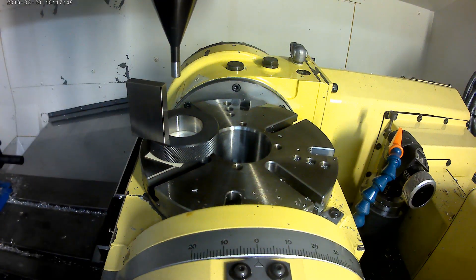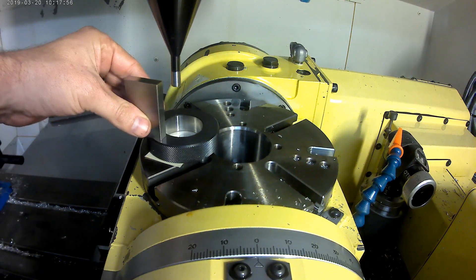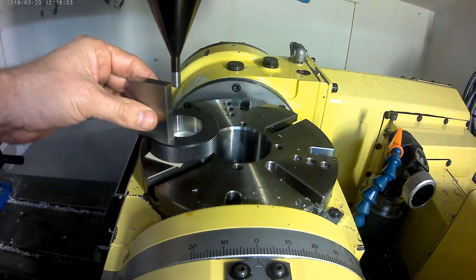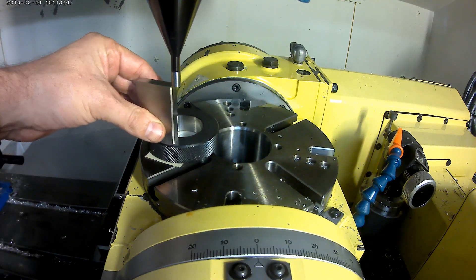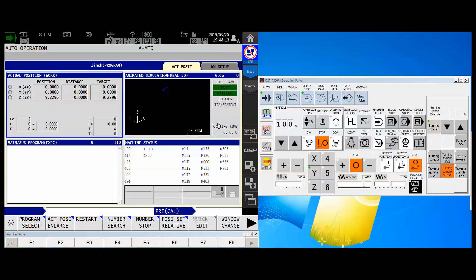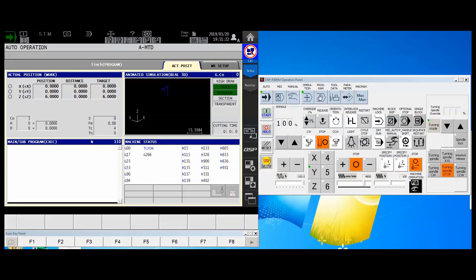Now that that's all set I'm ready to rock and roll. I'm going to find the Z position of my ring gauge by bringing my new four inch tool down to the top of the block. I'm using a gauge block here so that I don't have a little oopsie, but as soon as the gauge block fits right underneath it I know that my spindle face or gauge line is exactly four inches from the tool and two inches from the gauge block away from the surface of my part. I'll go back over to my work setup page, find the work offset I was using, highlight the Z, and I will calibrate — in this case four inches for the standard plus the two inches of the gauge block — that's six inches total. Now my zero position is set.